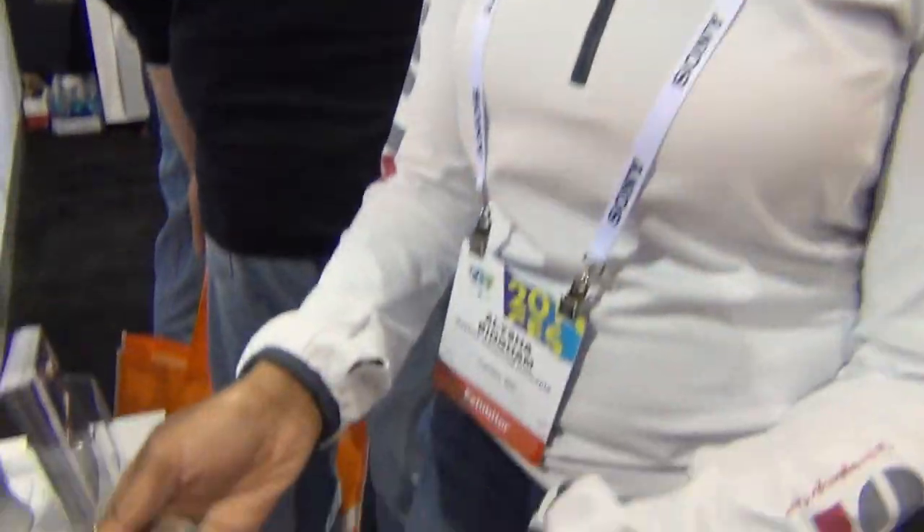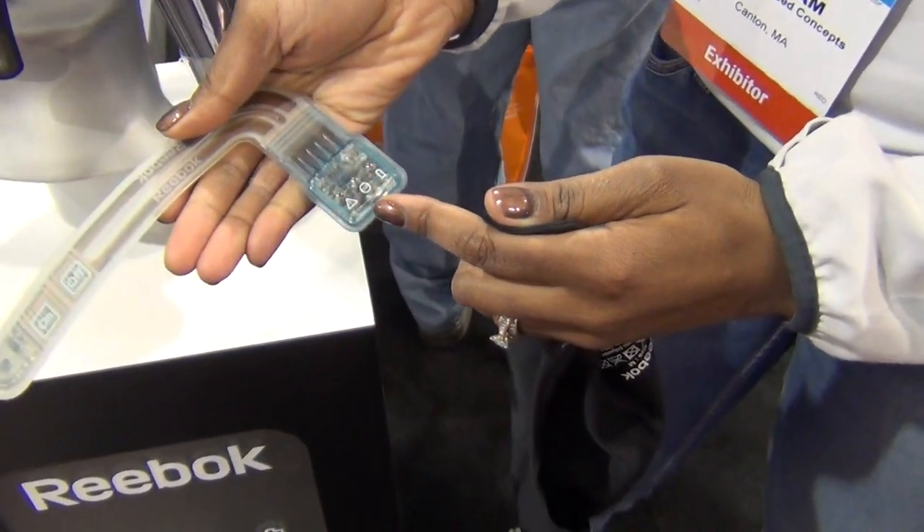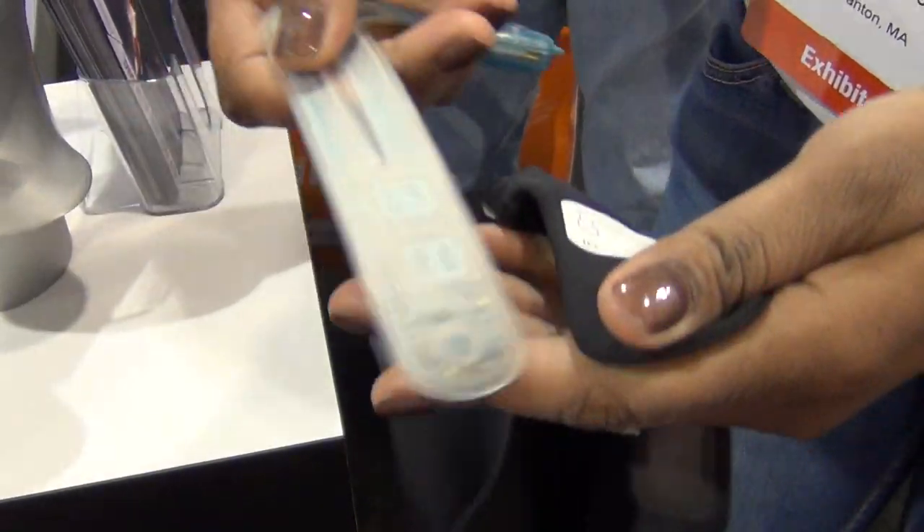When the device has experienced an impact, I'll trigger it for you. It's blinking green here — experienced an impact. It has a red light telling you it has to be a severe impact at this point. Inside, it's a three-axial accelerometer that measures the linear acceleration, and then you have a gyroscope that measures the rotational. Between the rotational and linear acceleration, we have established a threshold.